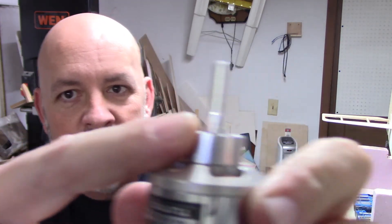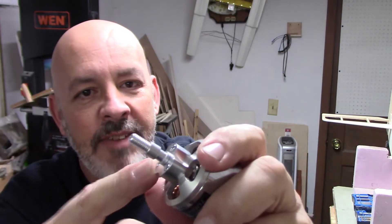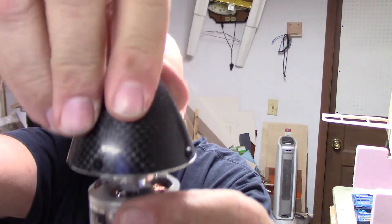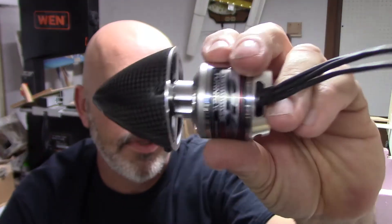You can see it's a little tiny one right here. I made it the height I wanted — about 90 thousandths high. Because it's a tight fit, it slides on the outside but it's tight down on the shaft. So I just beveled the inside and then pressed it on. It's on there and it's not going to fall off. When you put the spinner on it, it's a slight press fit — so it doesn't come off. It's rock solid. As soon as you put the prop on and it compresses down and tightens in there, it's not going anywhere.